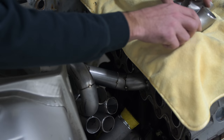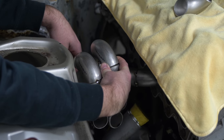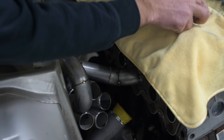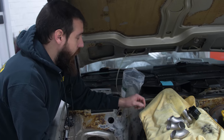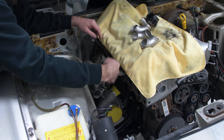If I can keep this one low, I think number five will be this one, which I can come up and over, keep it nice and parallel here, and then kind of work my way over there. Then I'll do the same with number four because I'm also going for circular firing order. The firing order on this is 1, 2, 4, 5, 3, and I wanted to keep that in a pattern circularly.